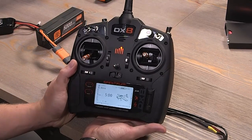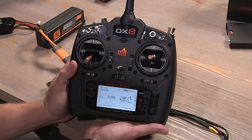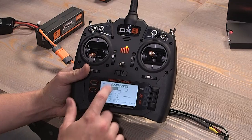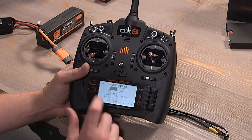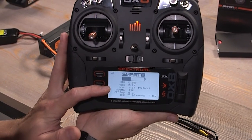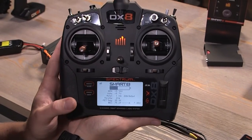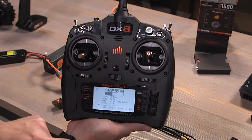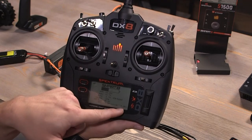We're all bound up. One of the great things about smart ESCs and smart receivers is they automatically tell your radio there's a smart setup and configure the telemetry for it. The first important screen is a general overview: RPM at the top, volts, and motor current — the output current. If I throttle up we'll see a little more, though there's no prop so not much current going through it. We'll also have throttle percentage, FET temperatures — the actual temperature of the ESC — and then BEC temperature and BEC voltage.